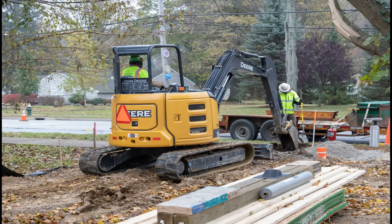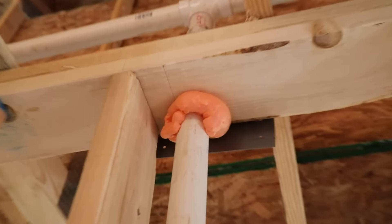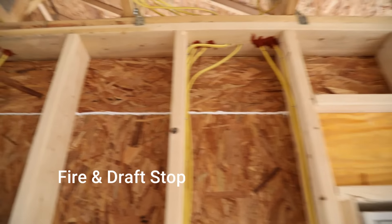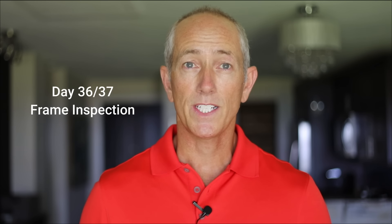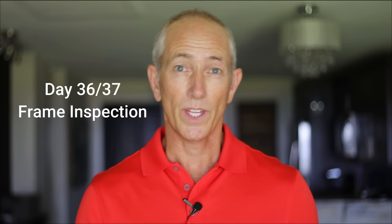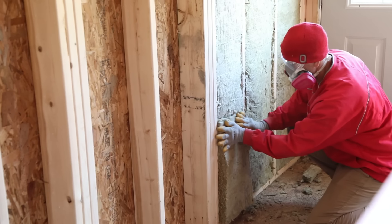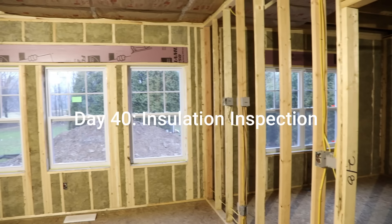At the same time we're going to trench the electric and gas from the street to the house. On day thirty-five we're going to use heat-resistant foam and caulk to seal up all the penetrations inside the walls to keep fire from spreading. We're also going to seal up any cracks or gaps in the exterior walls. At this point all of our plumbing, HVAC, and electrical rough inspections should be complete, so then we can call in our rough frame inspection. We need to have all of these items approved by the city inspector prior to insulating. Now we're ready to thoroughly insulate the walls and the attic storage area and then we call in the insulation inspection before we stock and hang drywall.